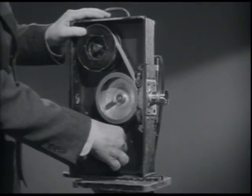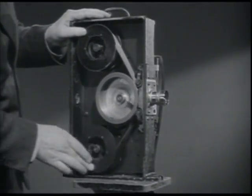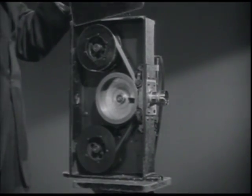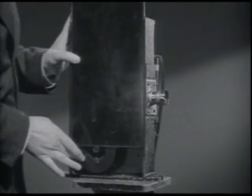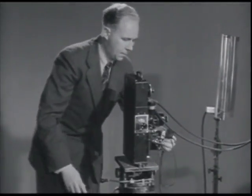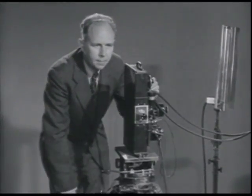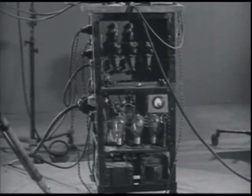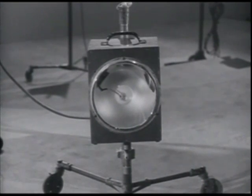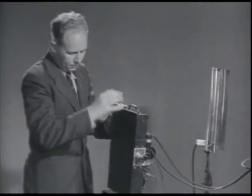While normally film runs through the average movie camera at 90 feet a minute, Edgerton's flicker box can handle 125 feet a second. The camera has no shutter. Connected with it is the unit containing the thyratron amplifier. Flashing on and off up to 2,000 times a second, this light makes 2,000 exposures a second on the film as it speeds past the lens.